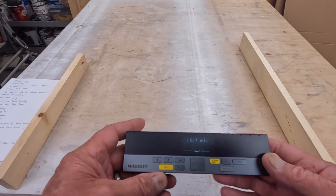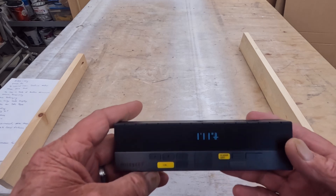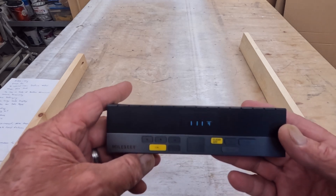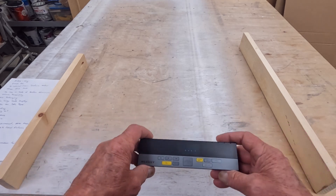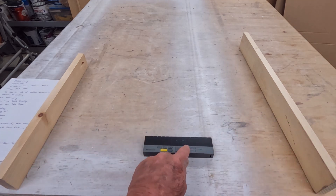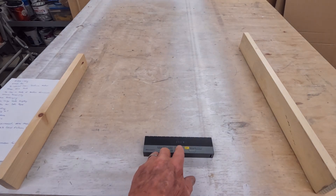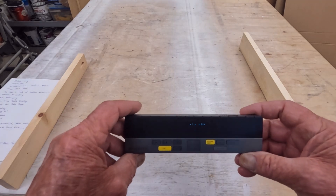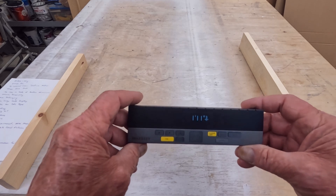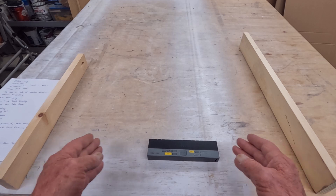Because this is the DP20 Pro, we have an option to change to an ultra-large screen. So we'll have one foot eleven and three-quarter inches displayed. If we lay it back down and clear it, go to the large screen and take a measurement, it comes up in the large display — though in the large display it will not show you the broken-down version of each individual distance.